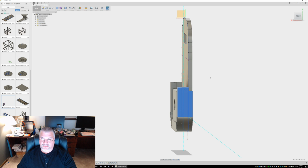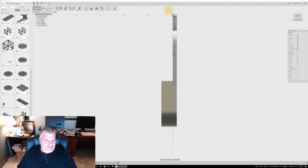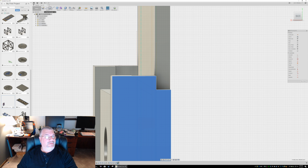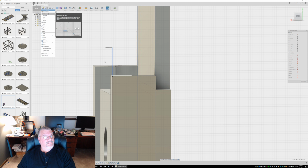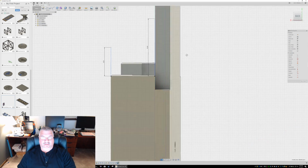So we're going to come up 8 from here. On command, I could hit P, does a projection. Not doing anything. Okay. So that right there, I want to come up 8. I'm going to draw a line, come up straight 90 degrees, and we'll go 8 millimeters. And I'm going to create another line from this point here, and we'll do this 16 millimeters. So these 2 points are what I'm going to use for reference.